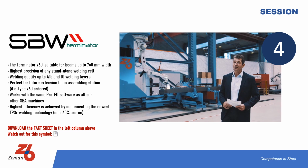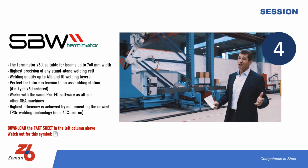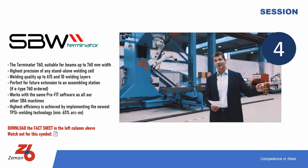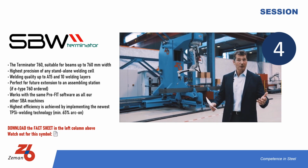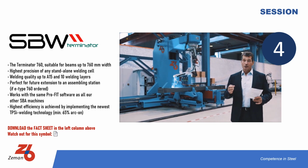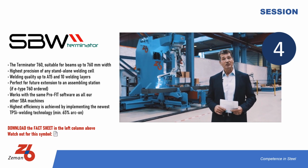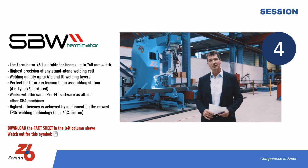The good thing here is we are welding out pre-assembled beams. That means pre-assembled either manually, but ideally, of course, on such a big machine as the SBA Conti Plus, or on the SR Compact, which you have seen in the previous sessions. This machine welds out on the basis of the same welding and assembly parameters that we have already automatically generated in our ProFit software.